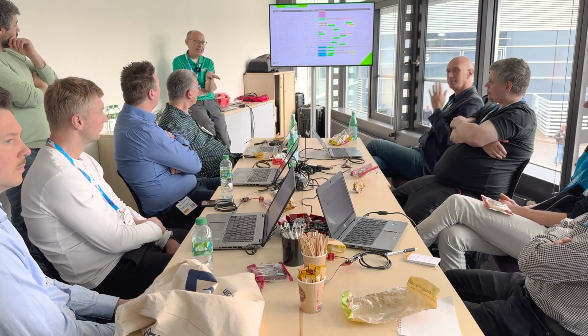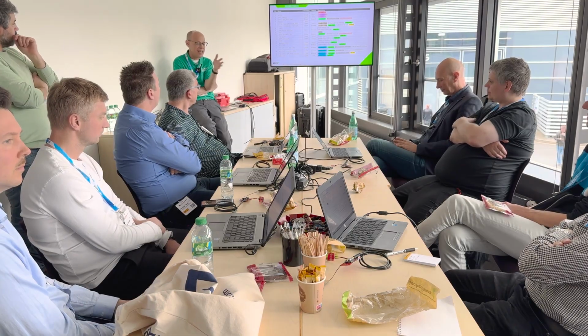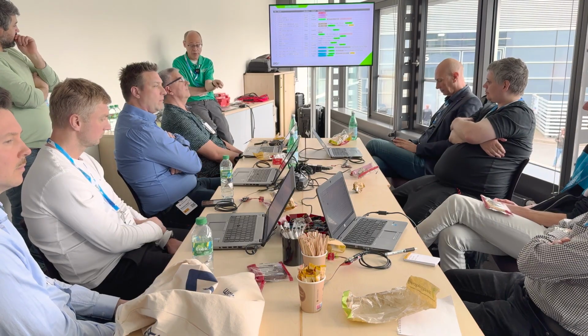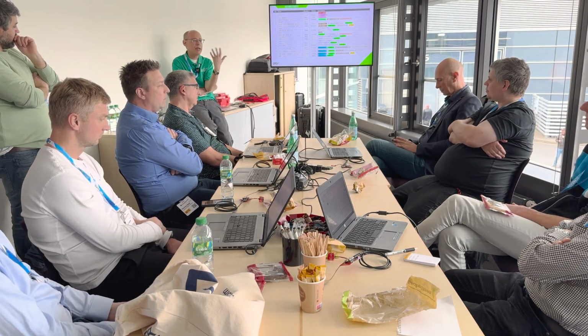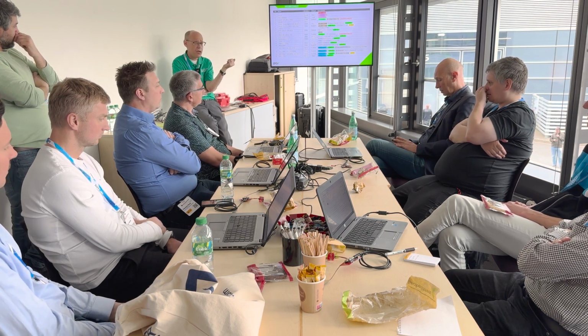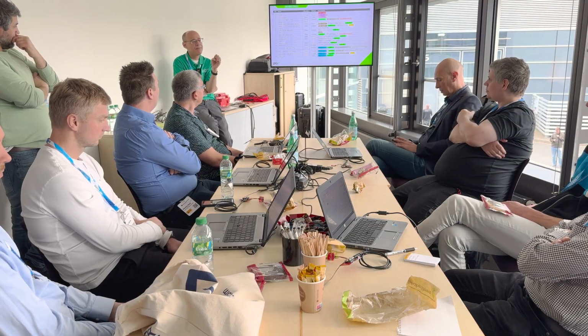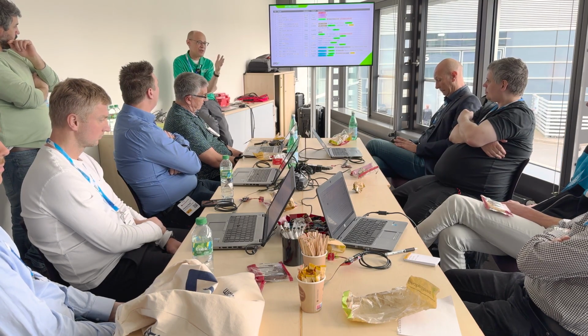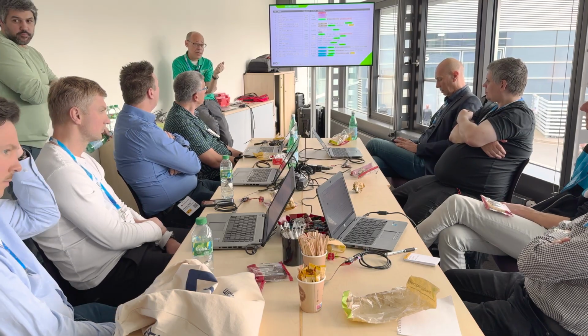Cat4. So LTE-M, not enough bandwidth to do that. Cat4 is enough. You might even need more, but that's the area where you want to start looking. I would not work with this particular module for that. But if your camera work is uploading stills or something like that, it's no problem. Even the Cat1 is going to be able to do that. For Cat4 for video, it's enough, even for higher end video, but you probably don't want to send tons. If it's a constant stream, that might be a little much. But it's also really good for managing the systems too, so depending.